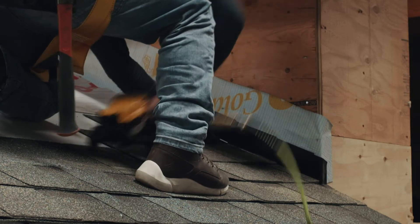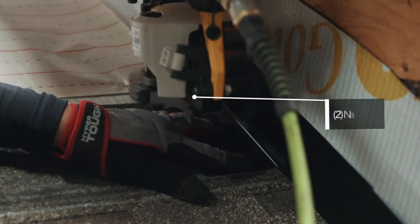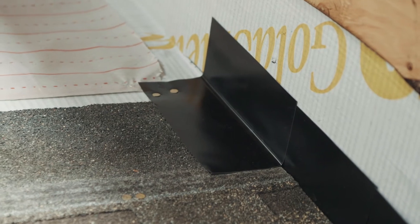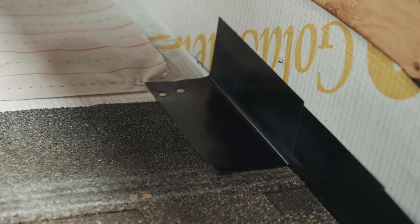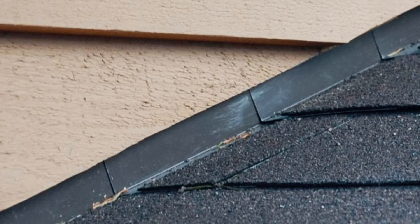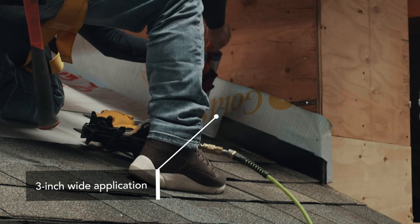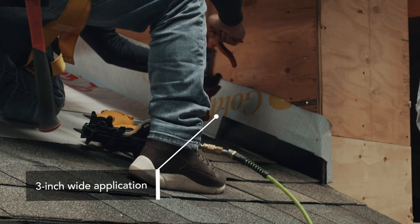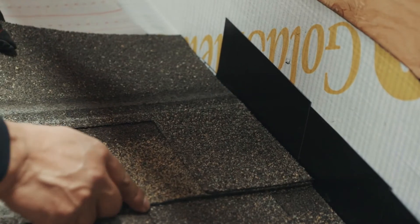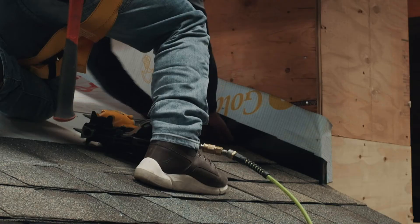As you make your way up the roof, ensure that you position the metal flashing piece in each course so that the overlaying shingle will cover it completely. The end of the shingle in each course, if installed with the correct shingle exposure, will overlap and conceal the step flashing. The end of each shingle adjacent to the wall must also be embedded in a 3-inch wide application of asphalt plastic cement. Flashing pieces and shingles in each course are installed on asphalt cement and nailed accordingly in succeeding alternating overlapping steps up the roof.